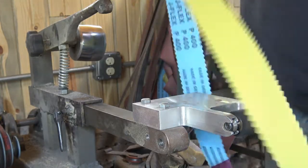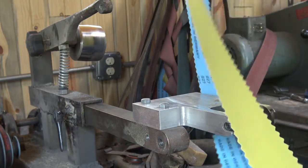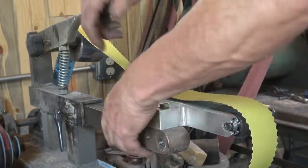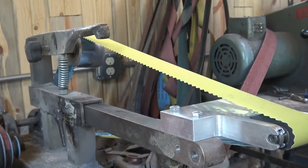We're going to switch to a 400-grit belt. This belt has a scalloped edge, so it's less likely to dig in and leave track marks on the inside of the adze. That makes for a really nice finish. It's a slightly softer belt than some of the others.